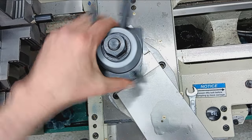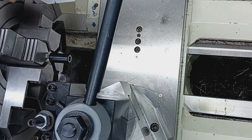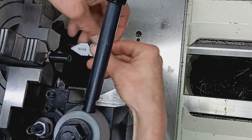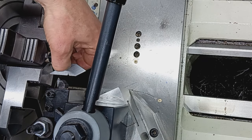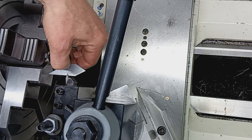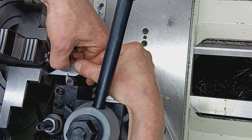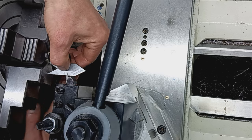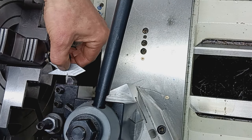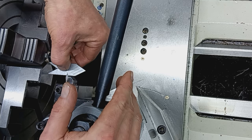We're going to leave the tool post loose and bring the cutting tool close to the work piece. To use the gauge, you're going to back off, set your gauge squarely against the work piece you're threading, and then bring your cutting tool into the gauge like so — holding the gauge firmly against the work piece. Come in with the tool like that, and look through to see if there's any light gap between either side. In this case there is not — this means the tool is squarely set to the work piece for 60 degree threading.